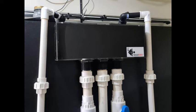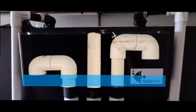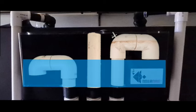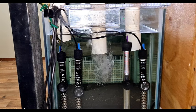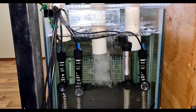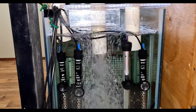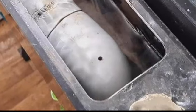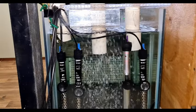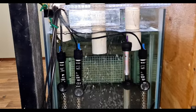So here's the box, and through the magic of television, here's what it looks like inside. As the box fills up, the water flows into the primary siphon, and that will force all of the air out of the primary line. If your line terminates below the water level like mine does, sometimes it will struggle to push all of that air out and it will create an air lock. Which is why I've drilled a little hole in the top of the pipe — that will let air out and allow for a full siphon. So once all the air is gone from the pipe, you've achieved a full siphon, and that will take the majority of the flow from your tank.